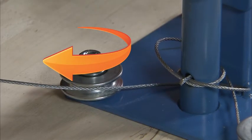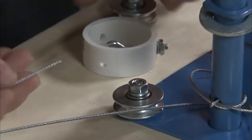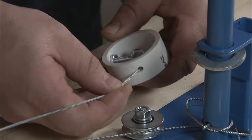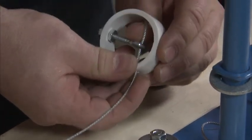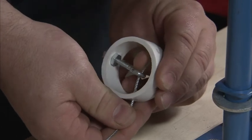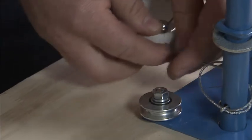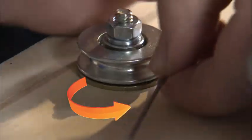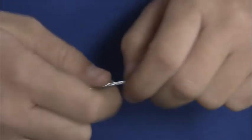Now we've got the cable running across the front pulley. Before heading to the back pulley, put the cable adjuster in — feed the end of the cable through one of the remaining holes on the cable adjuster, then through the bolt, and out of the remaining hole. Thread one cable around the cable pulley located on the floorboard and slide two quarter inch cable clamps on the cable end.